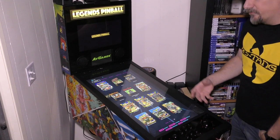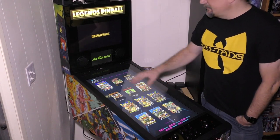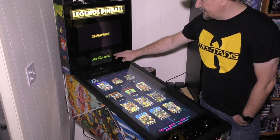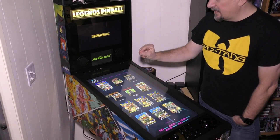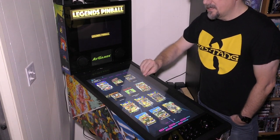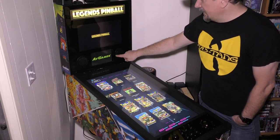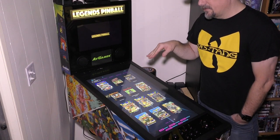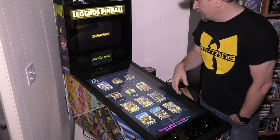I got impatient and I grabbed for the jigsaw with the plexiglass blade that I never believed in from the beginning because this is really thin. I think ultimately it would have been all right, but what happened was I set it down to cut with the jigsaw and I put it on top of something that was just a little bit higher. It was hard to explain, like a screw or a piece of metal that stuck up on the little table I was using. When this slammed down, because the jigsaw catches it and it was going so fast, it vibrated against that piece of metal just enough to crack it. So I lifted it off and I could see it was broken.